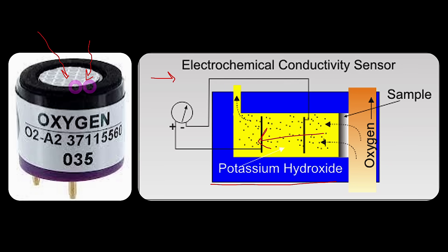There are of course disadvantages to this kind of sensor. First, you're going to age the electrolyte over time. Even though this reaction is a reversible redox reaction, it doesn't completely reverse, and at some point you essentially run out of the materials needed to perform the chemical reaction — the sensor loses sensitivity and eventually dies. The other issue is that it's a very strong function of temperature, so it needs continuous calibration for that. And it's slow because you have to wait for diffusion of oxygen and then the chemical reaction to take place. But the advantage is that it's quite small and extraordinarily sensitive, with very good accuracy if used correctly.